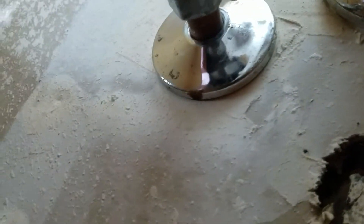We just bumped this and the trap dropped down and dumped the water. So we dried it up right there — it'll take a little bit for that to dry out completely. We're going to check those angle stops real quick and make sure that the packing nuts are dry. Let's dry that one off because I see some water back here.